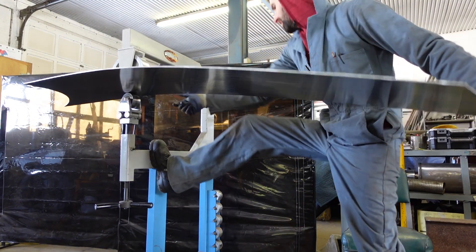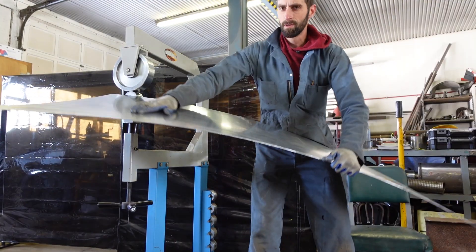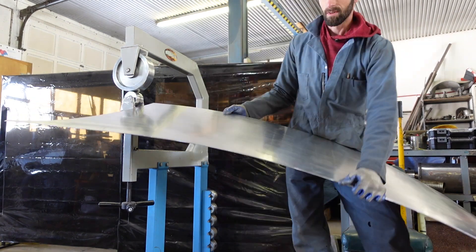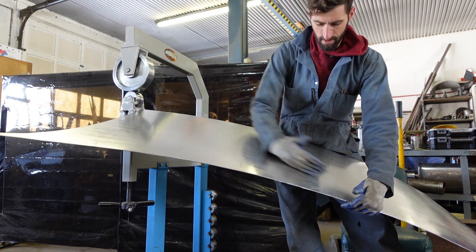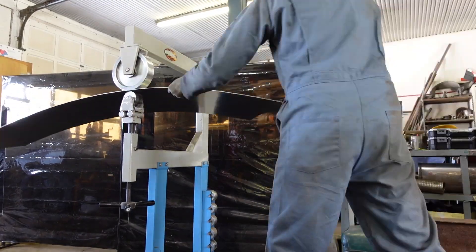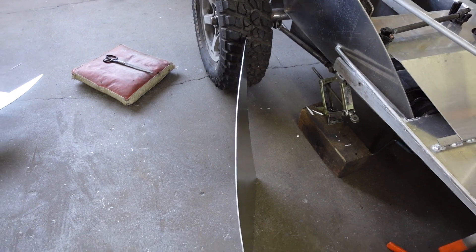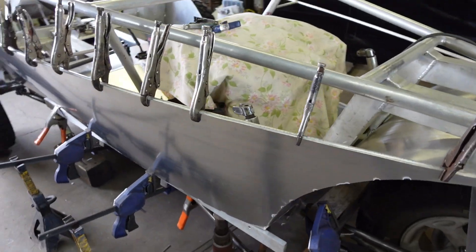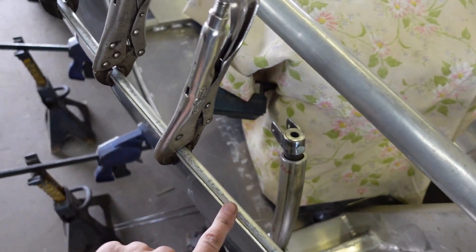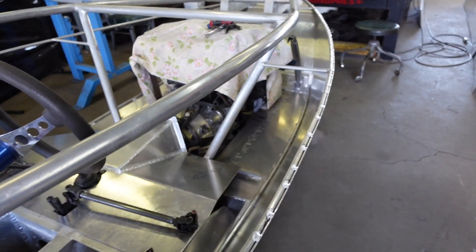Not sure why it's jamming up here — the bearing is coming out of the side, just causing some problems. What I need to do is get this side to tip in a little bit more — it's sticking out. You can kind of see how much shape is in that panel now. Got about every vice grip I own clamped on there just to hold everything solid while you're tack welding it.